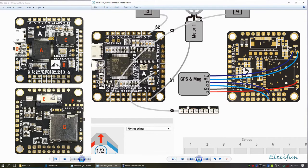Now, I don't use these because I don't have a power supply or a power distribution board that has one of these connections on there. These, and also on this, as you can see, and I'm pretty sure on this one as well. Yeah, we've got one here on the new board as well. That actually takes up a UART. On this one, you can see it's indicated there for RX5 and TX5, which is the receive on UART5 and the transmit on UART5, and that will be the same over here on this board, whether it's UART5 or not. I can't remember, doesn't matter though, because we've got plenty to do what we want to do. Fortunately, like I said, there's a built-in on-screen display on both these boards, where I normally use up another UART, but on this I'm not going to. So right, enough to do, let's take a look at the build itself and see how we're going to do this.